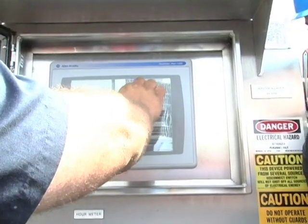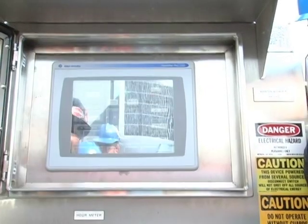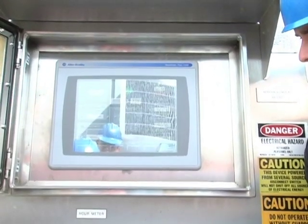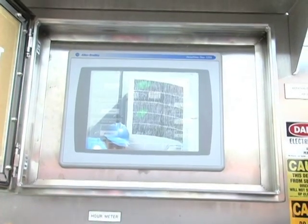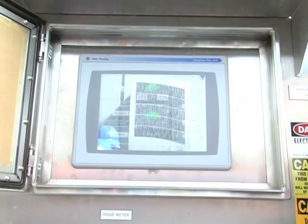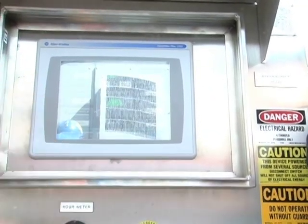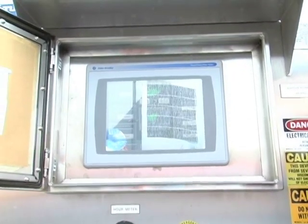Here's the RI calibration we talked about — you can't do anything with it in service mode. If you go to normal mode, now you can activate and calibrate both of them. You can see it running open. The inlet guide vanes won't calibrate because that switch got busted off — I've replaced it once, it got busted again, so I'm not replacing it until next time. But the diffuser will hit 100%, then close back down, find zero, and set those two numbers. The nice thing is if that actuator arm goes bad, you replace it and don't have to set any zeroes — it sets off the switches wherever it ends up.